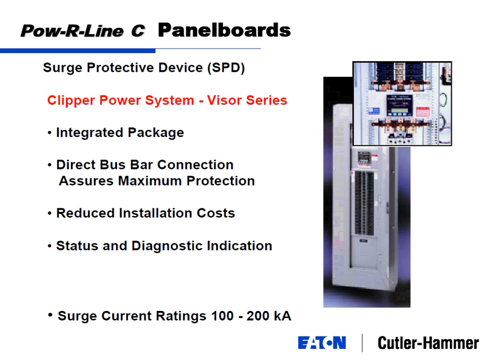Number one problem with the operation of an SPD is contractor installation. The nature of an SPD is that it is designed to reduce the transient voltages in a facility. And I will say there's just a couple of ways that they're going to come. You're going to get them from outside the facility, which are lightning strikes, or if you're next to a plant that opens and closes capacitors online, you've got some big switching banks or something, you may get surges that come from outside trying to get into your facility.